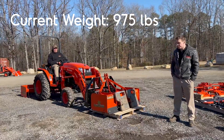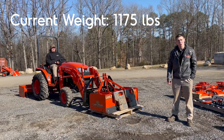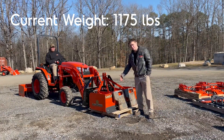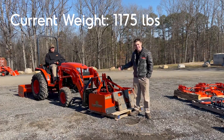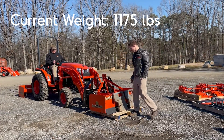I just added 200 more pounds to it, so now we're going to be at probably about 1175 pounds on it. I put this weight at the front — remember the rated lift capacity is towards the back, towards that pivot point, towards the quick attach point — so the further out we go the more difficult it is. Chris fired it up, let's see if it does it.